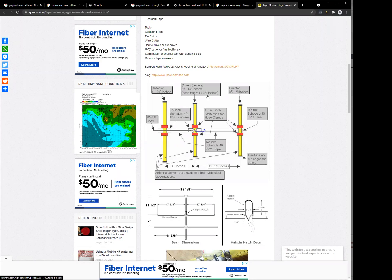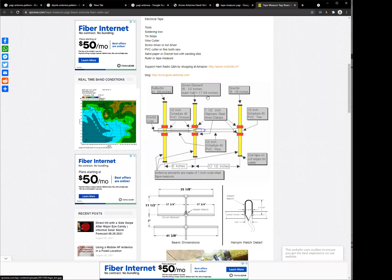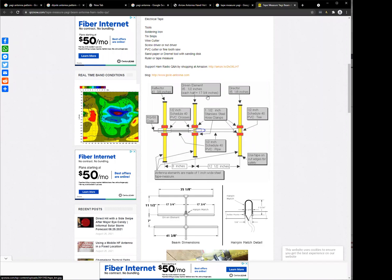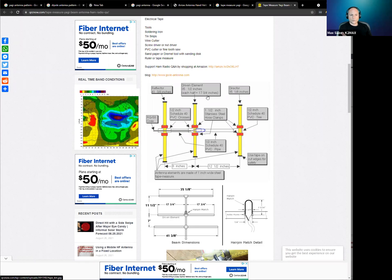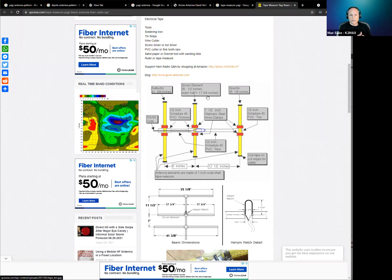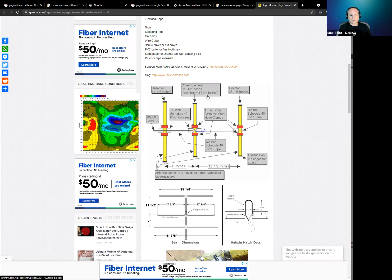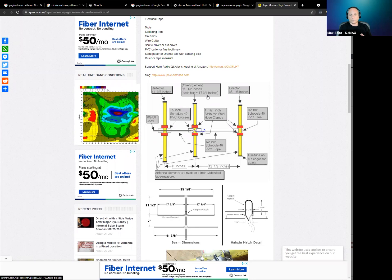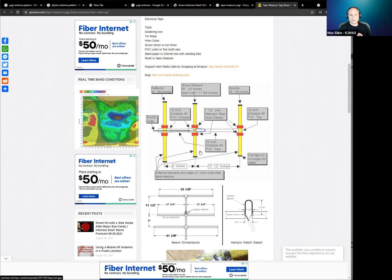So if I understand this correctly, when you said this is your dipole right here, each of these yellow and red segments on this Yagi diagram on the screen is itself a dipole, and you'll do the SWR for each, lengthening or shortening? Yeah, so only the center one is the driven element, and that's the one that the coax is connected to. The other ones are really just the shorter one is a director, and the longer one is a reflector. The SWR is going to be affected somewhat by the length of the director and the reflector, but you're going to affect the pattern more than you will the SWR. So for those, you just want to make sure that the measurements are correct for the dipole that you're building. But the dipole is in the center, and that's what you want to adjust in order to get a good match for your SWR.